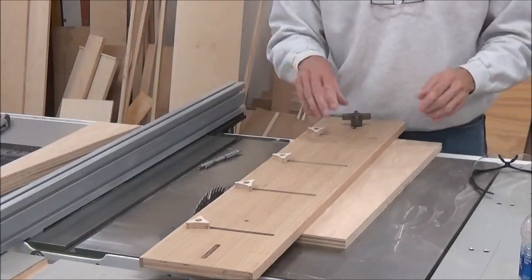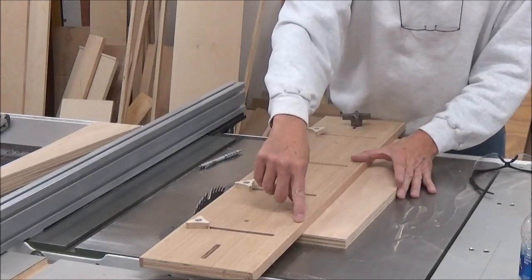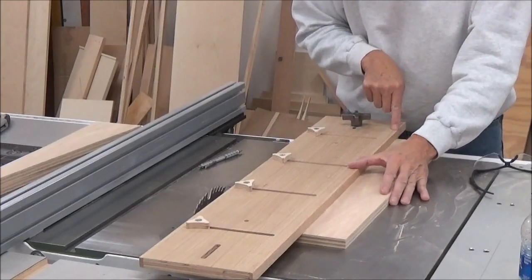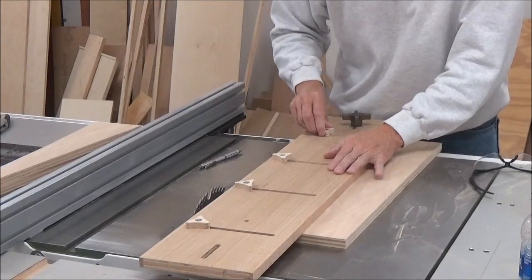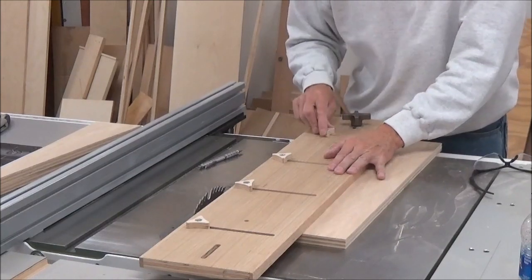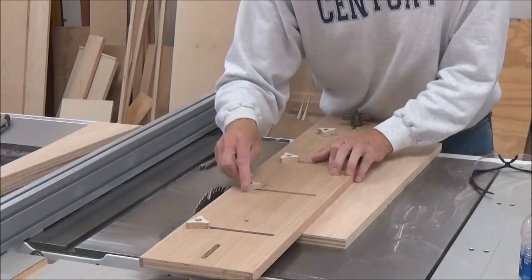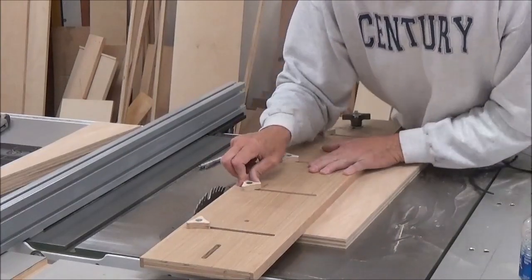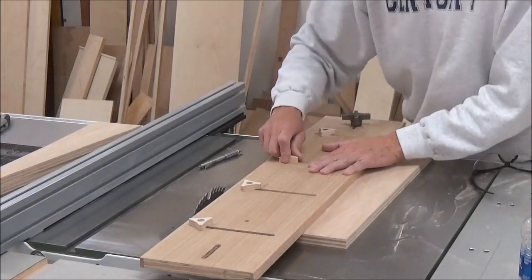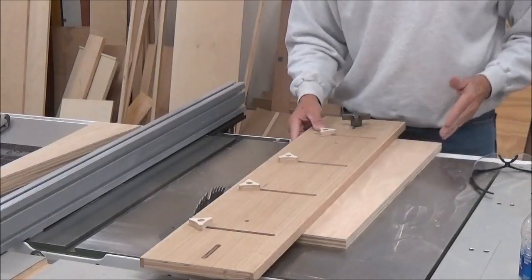Okay, so what I had to do was offset this jig by 4 inches and 3 inches. So I've got my jig on its mark up here on top, and I'm just covering it on the bottom. So what I'm going to do is slide these over. I've already adjusted this taper part, so that's tight to the bottom. Move that over. Move that one over. I really don't, like I said, I don't need 3, but I've got them. I'm going to tighten this one up so it doesn't wiggle off. Now those are making contact, and now I know I'm set to make this cut.